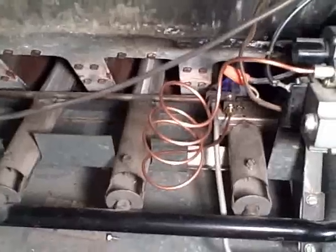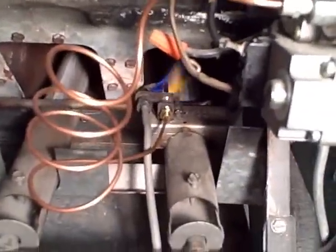You just lift up on it generally and pull it out. Now I've lifted the plate off and you can actually see into my furnace. If I turn the light off, you might be able to see the pilot light on. The pilot light was not lighting yesterday, and what I needed was a new thermocouple.